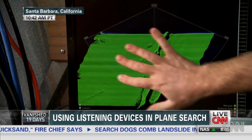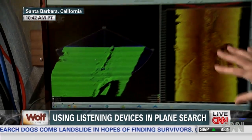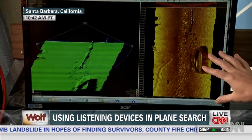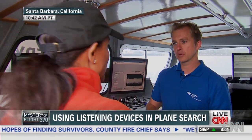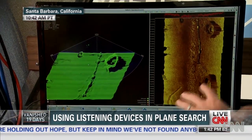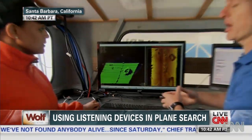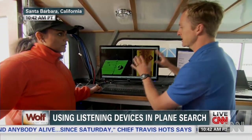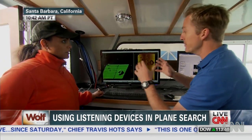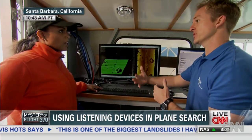This is a 3D point cloud of what the structure of the bottom looks like, and this is an image of what targets and objects are on the bottom. But this is a really slow process — you can't just move the boat very fast through the water. More complicated than that is that these sensors need to be near the bottom. If we're in the southern Indian Ocean, that means they need to be thousands of feet down. That's the real complication: to get sensors like this near the bottom and then map out small segments of seafloor and build up a large map of the seafloor.